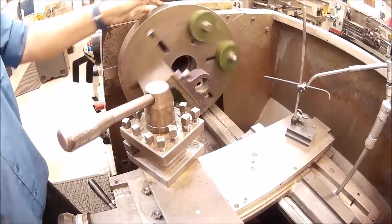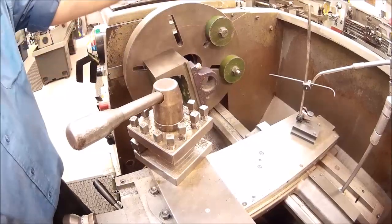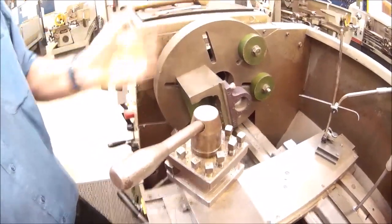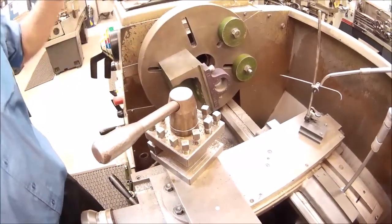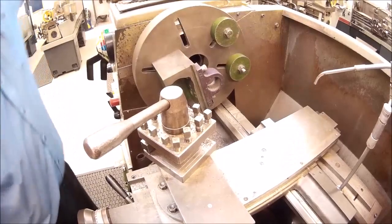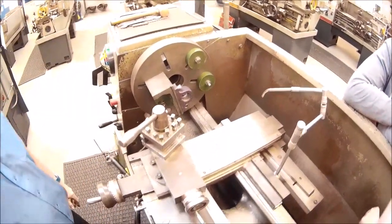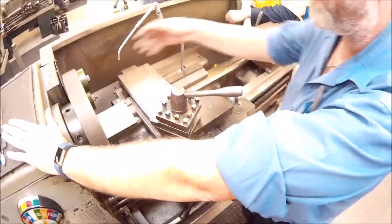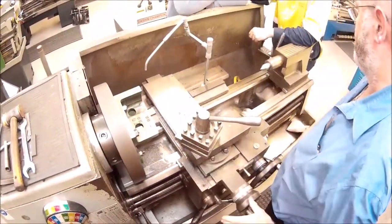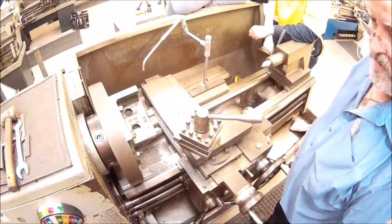Alright. Safety issues when we're looking at faceplate turning. If you look at the front of the lathe, I've got a lot of stuff spinning around out here that can grab me or drag me into the machine. So it is imperative, whenever you're using a faceplate, that you keep your headstock clear of any loose items that could possibly fall in there and get flicked off out across the workshop. And always stand in this position. Never ever reach across like this. It doesn't take much, a little slip and then you go. Okay? Keep yourself away from the job, and protect yourself using the tool post.